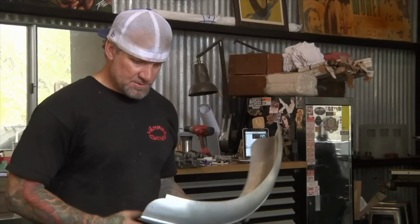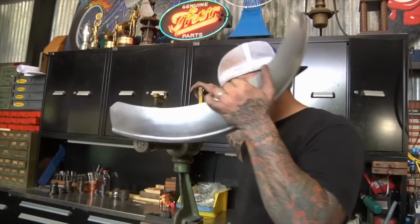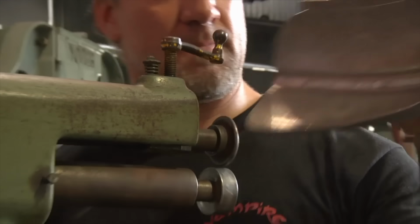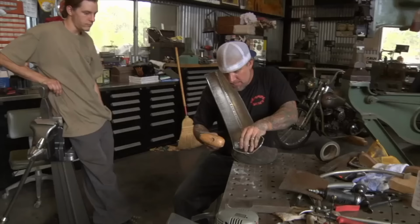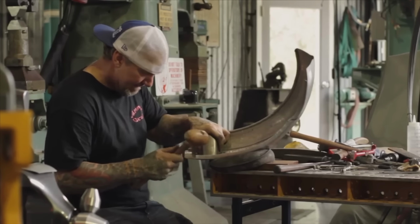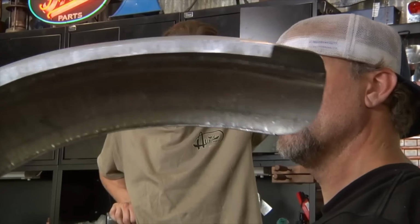Ready to roll it. So we'll scribe the inside of this half inch. Let's do this side first. The smoother you can make this line, the smoother that lower edge will be. And then it looks cool just like that. It adds strength, too. Getting there. Look how much better that looks. Taking that edge away.